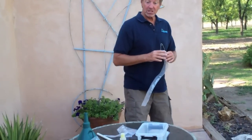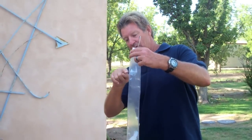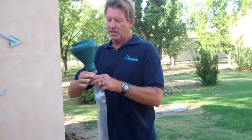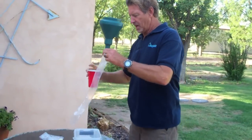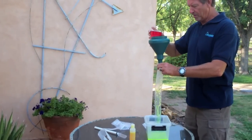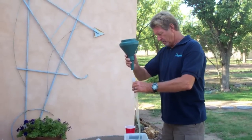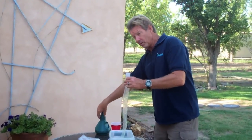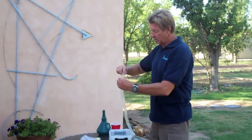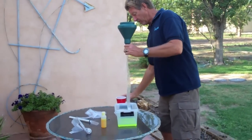I'm going to demonstrate this — this will be sloppy. This is a hydrosleeve, same thing — we just have a spring holding the top open. The reed valve's in here, but we cut the bottom off. As we pour this dyed water through here, you'll see it just pretty much flows unimpeded through the sampler and out the bottom. The advantages of this type of check valve are numerous: it fills a lot faster, and now we just pull the hydrosleeve up in a single pull to fill it. It seals a lot easier, opens easier, and we can also package them in flat packaging, which allows us to put up to 100 of them in an overnight envelope of this size.